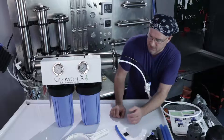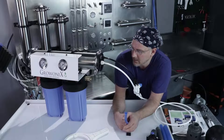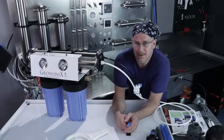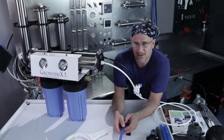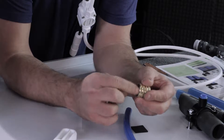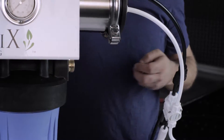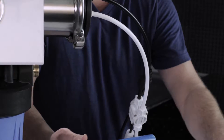The very last thing to connect is the input water supply — the feed water supply. These units come standard with a brass three-quarter brass garden hose swivel adapter, included by popular request so people can connect in a pinch since everyone seems to have a garden hose. However, garden hose is not ideal for permanent installations because garden hoses seal through little flat o-rings instead of sealing through the thread like an MPT fitting. For a permanent installation, the brass fitting should be replaced with quick connect CTS fittings or Schedule 80 plumbing.